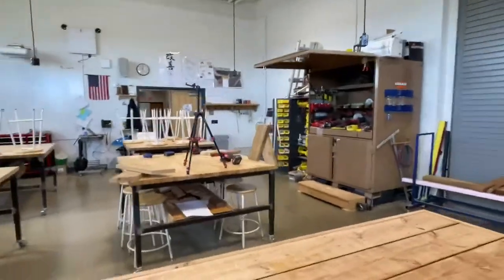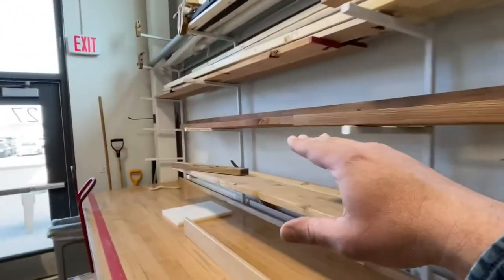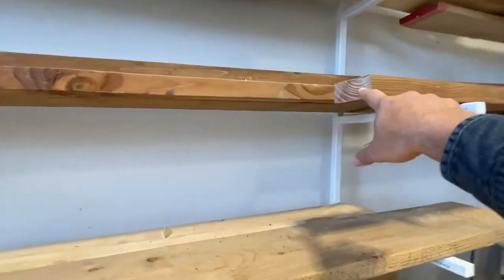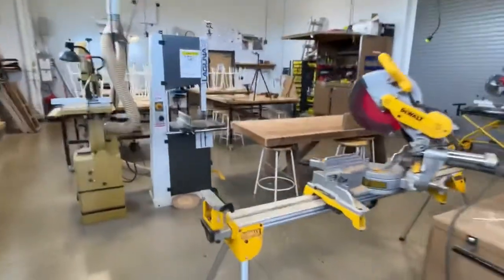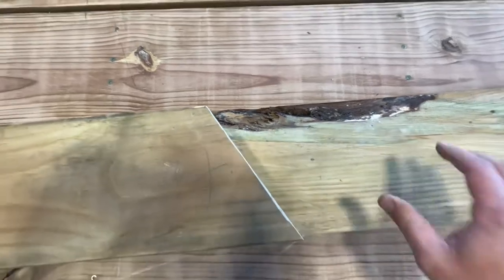Let's talk about how to put these legs together. When I'm looking for material — this one had already been cut and was extra — I need a set of these to go together. I can go out to the yard and grab a 16 footer, but first look at this rack up here. This is our usable project storage. We've got treated lumber marked up here — if we've got two by eight profile up here, which we do, I want you to pull from that. If it is not labeled on the end, if there's nothing written on the end of the board, that means it's fair game. We're always going to put our names on the ends of boards if we have cut them to length and claimed them. I found a piece up there that was fairly rough — it's got some live tree edge issues — so we'll play a little bit of Tetris here. We can see that if we lay this out, we'll need to get our 30 degree cut on the end, but we can just get away with cutting here and making something valuable out of this piece.